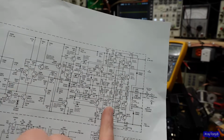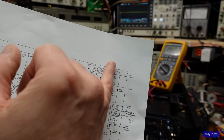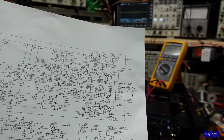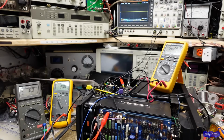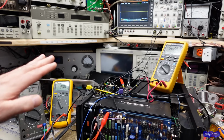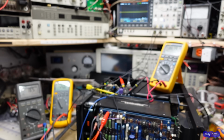So at 1.5 milliamp per millivolt, if you set it to somewhere around 15 millivolts, and then you look at the amount of voltage that's across these transistors, they're going to each be dissipating somewhere. You want them to be dissipating around a watt, maybe 1 watt, if that, or less. Just enough for them to be turned on and idling. And again, between 4 big power transistors, that's really nothing. All it's going to do is give us the ability to have very low or no crossover distortion. That's really all I care about. The higher you make these things idle, the hotter the thing's going to idle at. You're just going to make heat for no reason at all, and we don't want that.